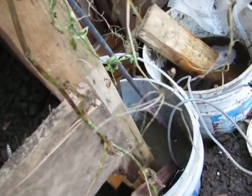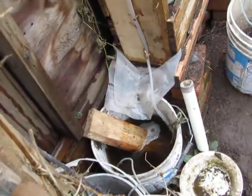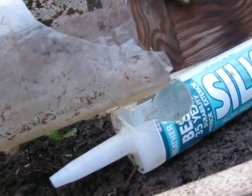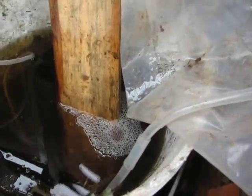This bucket is 15 inches high and this bucket is 14 inches high, and as you can see the water is down maybe almost 6 inches in one. So the submergence that's pumping the water up here is pretty small — I didn't know it could go down that small. Water is coming up here and coming in here, really fast in this one even though it's going higher. It's just a different amount of air coming up. And as you can see it's just cycling around.